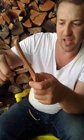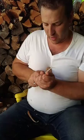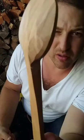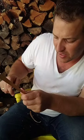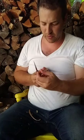You're never going to be able to come down and exit going across the grain of the shoulder. Sometimes I can come down the neck and exit before I reach that shoulder, but I have to be super controlled and careful about it. With the pull cut, you're generally not controlled enough to stop yourself from doing these little nicks. That's why I have this order of operations — come down and then do the thumb push going up. At that stage of cleanliness, I leave it. There's no use chasing it further.